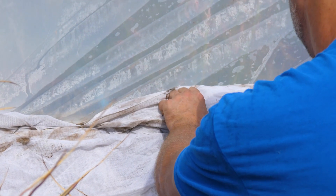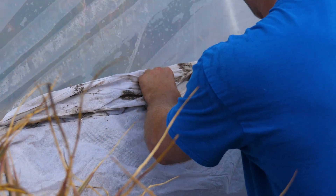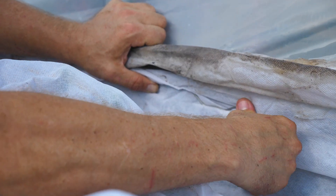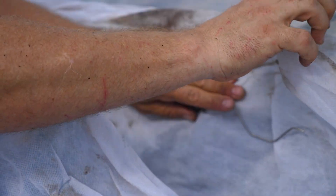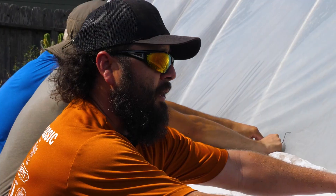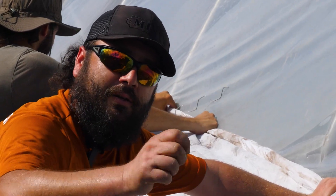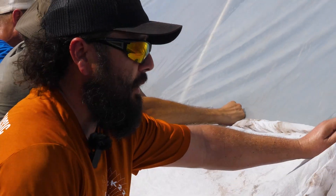It just pops in. I'm glad we got ahead of the weather, because when you're doing this when it's cold and rainy it's a lot tougher on your hands — your thumb just starts aching real bad. Sometimes I hit things that don't work, so I'll skip that spot, get under that piece, and leave it loose so it can come undone — otherwise you need scissors to get it out. It's also important to wear safety glasses, because the end of the wiggle wire can be flopping around. You just have to make sure you don't poke yourself or somebody else in the eye.